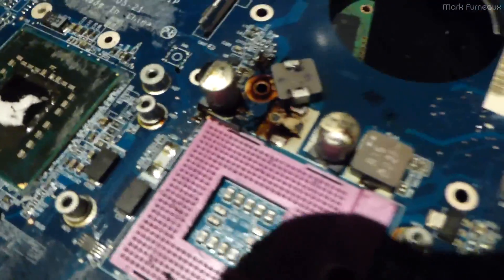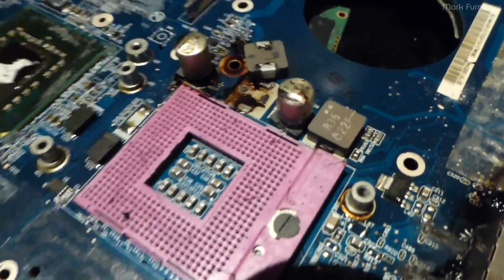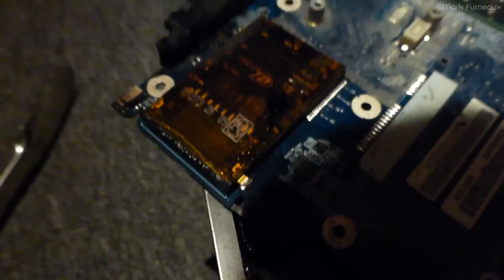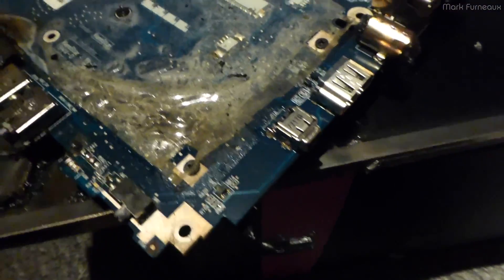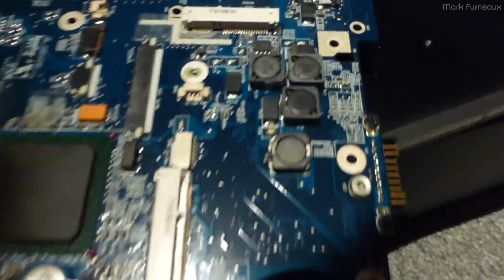The motherboard — you can see this inductor here is blown completely off the board, and the caps are bulging a little bit. The electrolyte most certainly vaporized inside there. Most of the damage is around the plastics — all the connectors on the edge melted, the phono and mic jacks have melted, the volume control is liquefied. The Kapton is still looking perfectly intact, no surprise there. The insulating sheet started to bubble a little bit. The other side is just the same — pretty much just the connectors, nothing more than that.